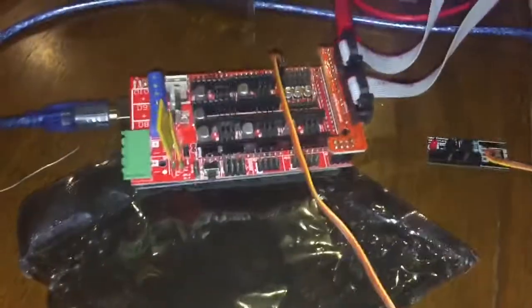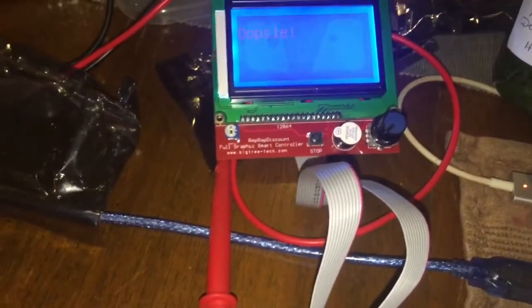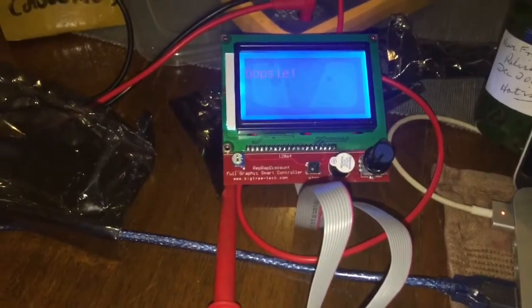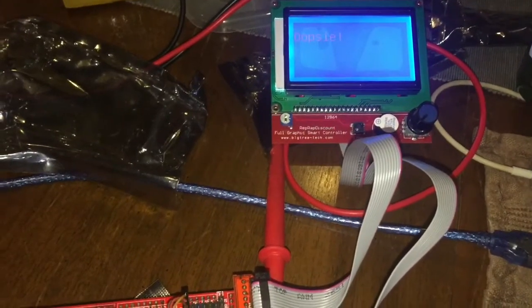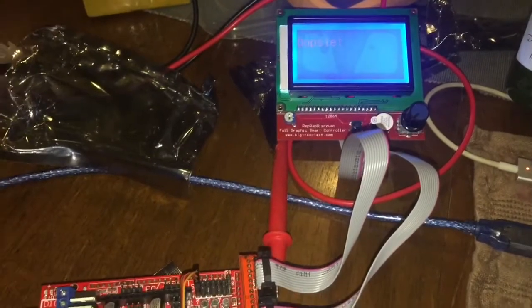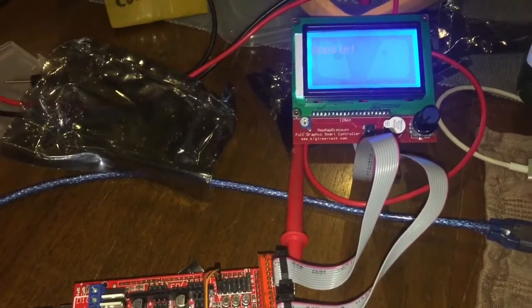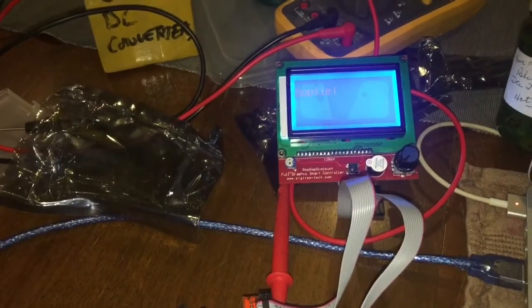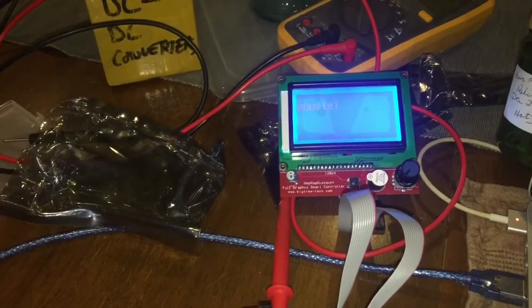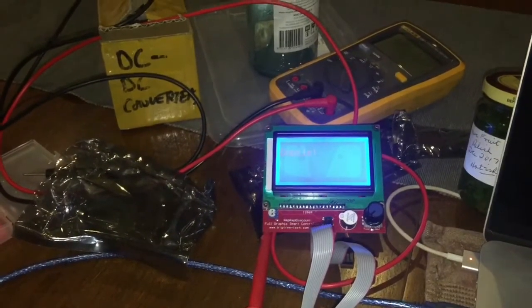One of the things I was planning to do with the AL960 was add some programmable functions, and one of those was a tachometer so I could actually see what speed the spindle is running at. Secondarily, I'm hoping to connect that up to the VFD so that I can set spindle speed from a controller. The third thing I want to do is hook the spindle speed and the controller up to a DRO scale on the cross slide so I can tell the offset from center and adjust the drive speed to match surface feet per minute — so the closer I get to the center of the part, the faster the machine spins.